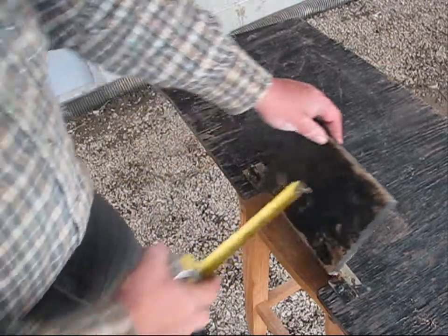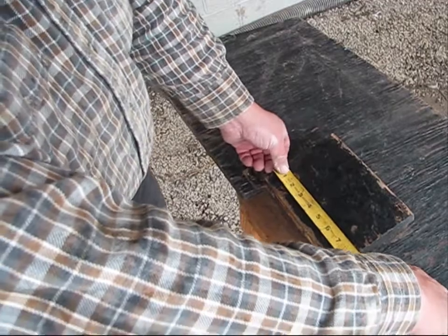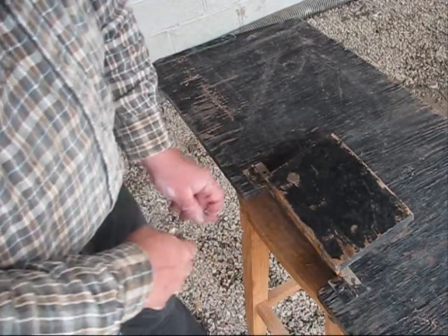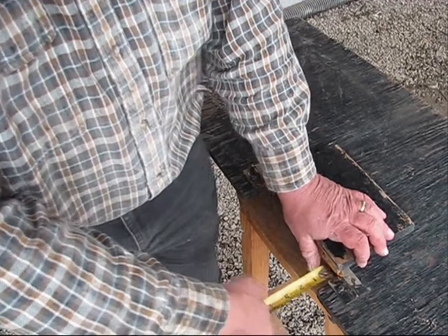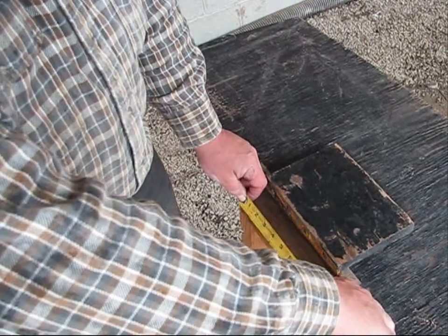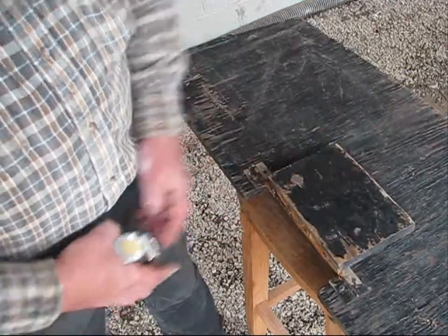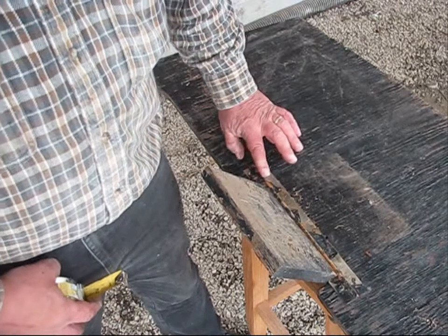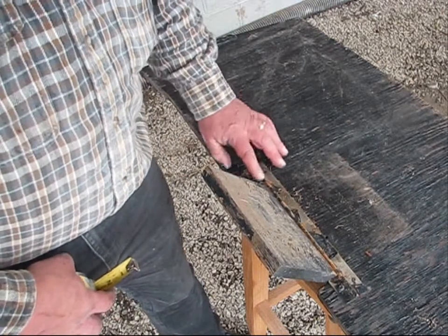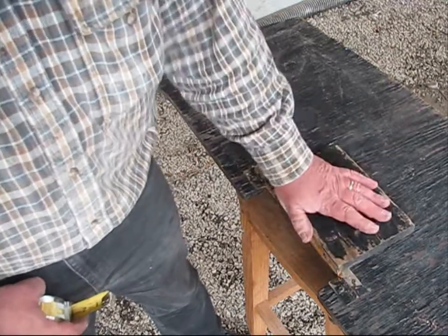This transom piece is going to be 5.5 inches by 8.25 inches. So your cutout here on this back transom is going to be 1.5 inches deep, of course, by 8.5 inches for this to fit into. You just take a little piano hinge, short piece, and it doesn't look like it's anything special, but it's got notched here, so it'll work just fine.